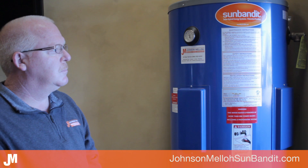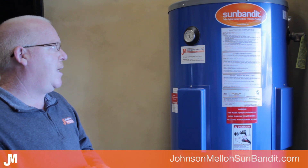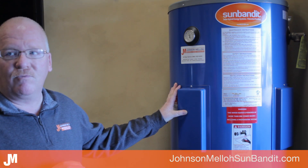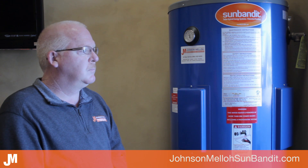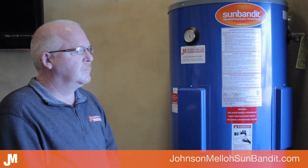This is energy storage in a very pure, simplistic way. Even off grid, we've been storing 160-degree water every day in this 50-gallon model — storing 50 gallons of 160-degree water that we haven't depleted by the time the sun comes up the next day. If there are several overcast days or not a lot of sun, you're still going to have hot water because there's a grid connection with an electric element in the water heater.